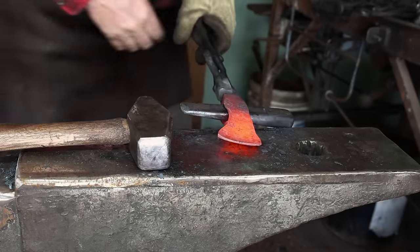Drifting over the open vise helps prevent damaging the ears of the axe, and it works pretty well ergonomically. This drift is getting pretty hot at this point — the hot mill gloves are just barely enough to keep me from burning myself, and I'd easily burn myself through leather gloves, so be careful when picking up a drift you've been working with. I don't like quenching the drift because I don't want it to suck all the heat out of the eye, so leaving it fairly hot is a good idea. I've been at this for about three hours and there's a lot of clinker in the fire that needs to be cleaned out, so I'm going to clean that out, then bring the tomahawk head up to a dull red and let it cool down with the fire while I take a lunch break.